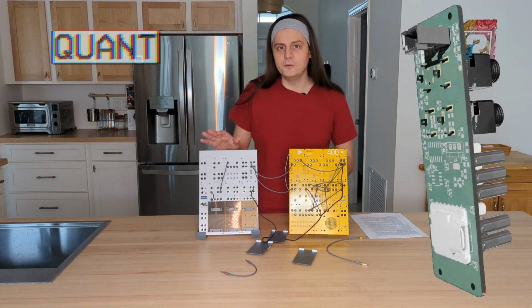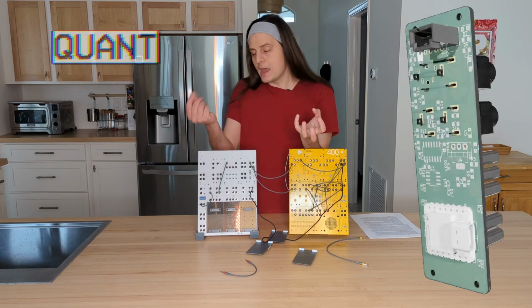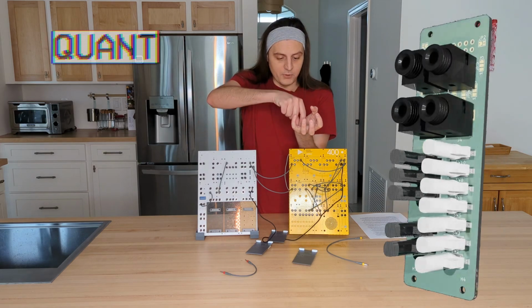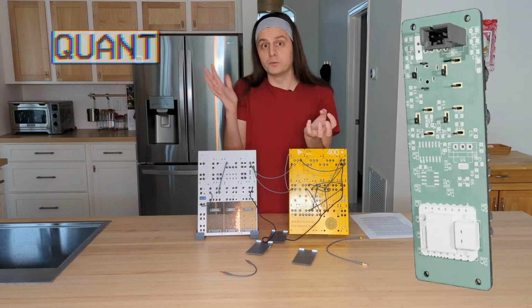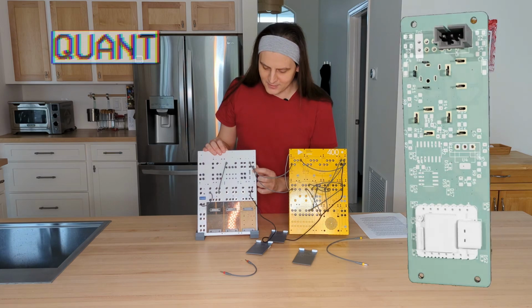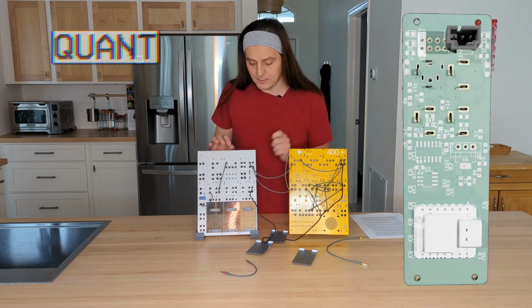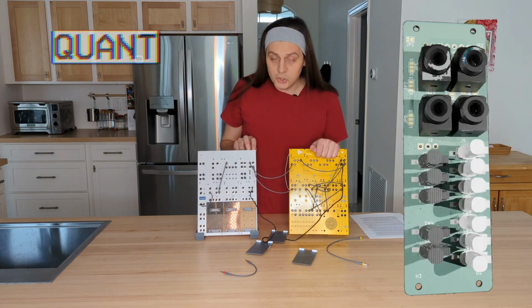I've used this design in a few places here. On the back of this 3D printed case, there's like a shroud, and there's a separate 3D printed button that you put into that, and then the board with the real buttons on it that sandwiches it in place. So you get this awesome little click, but the buttons are locked in place. They can't move and they can't spin. This one has two inputs.